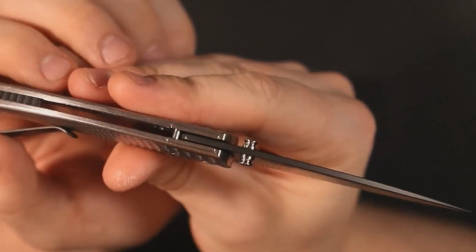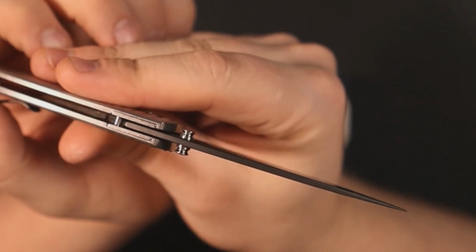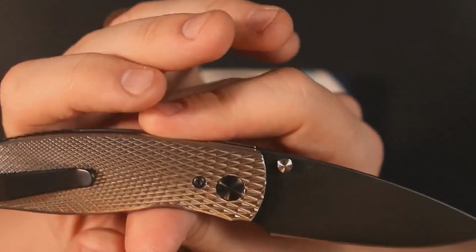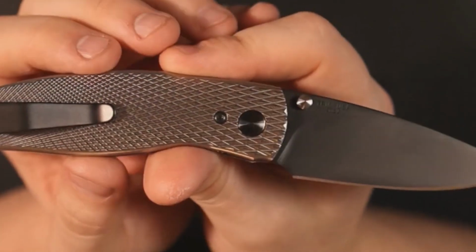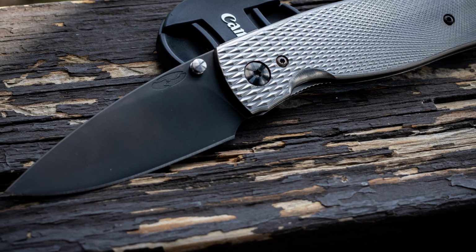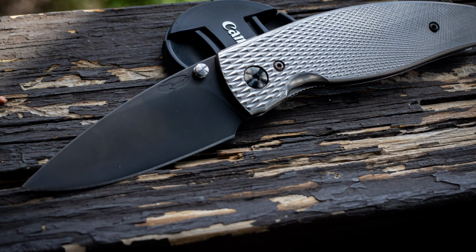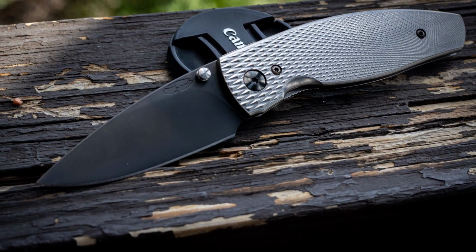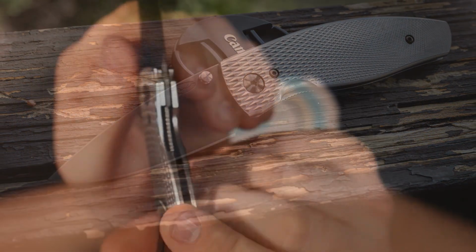Also, if you're familiar with the TRM Atom, this continues the pattern of having extremely thin blade stock. Now that's important for cutting geometry, and it's also important for edge retention. Blade geometry, edge geometry, all plays a role in how slicey a knife is, and also how well the edge will be maintained. So when you order in this configuration, you get the DLC coated 20 CV blade, these beautiful titanium 3D milled and contoured handle scales, and then of course it is a liner lock.